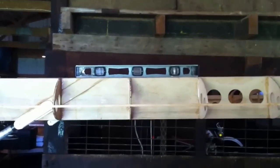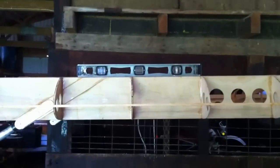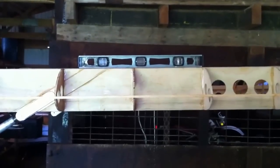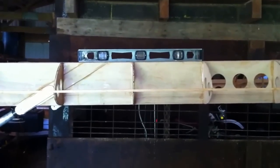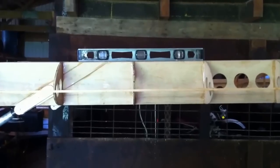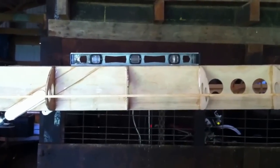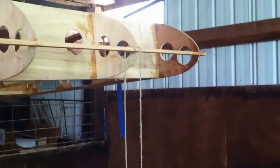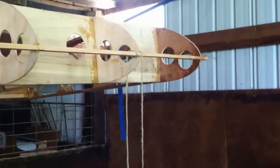You're probably supposed to do this, but I just kind of invented it on my own. What I did is I leveled off the top of the wing — I found a spot where I could level the wing, and I'm real confident measuring and double checking that I got the wings level. I took a measurement using a homemade plumb bob — a heavy brick — with the wings level, and I wrote it right on the inside of the wing. I think it was 65 and a half inches.